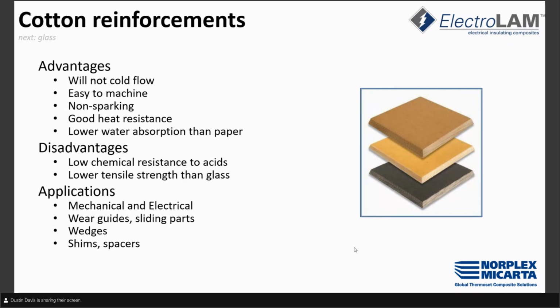So cotton is used as Class B insulation in electric generators and devices where it's up against copper and you don't want the glass. Cotton and our canvas materials, some of them specially formulated and post-processed to ensure great dimensional stability, are used in those environments in the electrical devices.